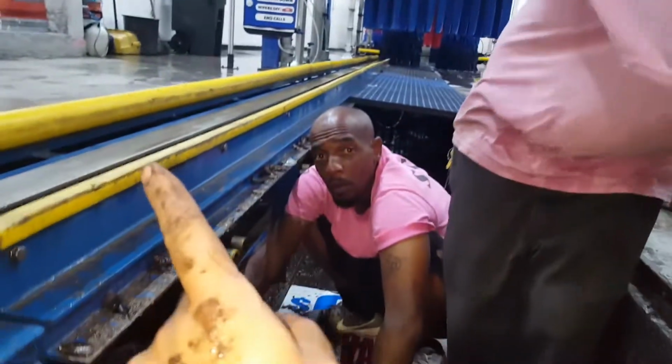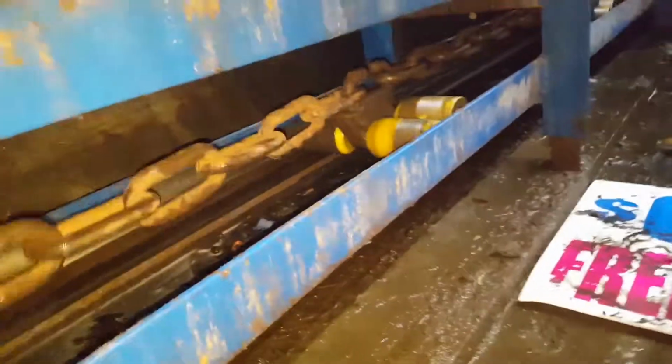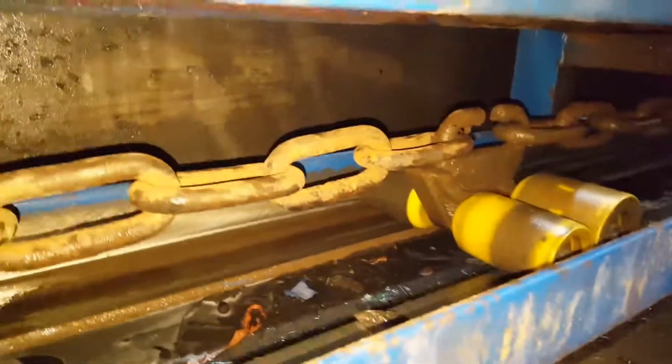So now, you're gonna go to the back room, that little black valve there, and you're gonna flip it to the opposite end to put the air on. Good. So now we've put the tension back on. It's nice and firm. Now before we start the conveyor, we wanna confirm again. Flat, up, flat, up, flat, up, flat, up, flat. 1, 2, 3, 4, 5, 6, 7, 8, 9 links, previously 11.